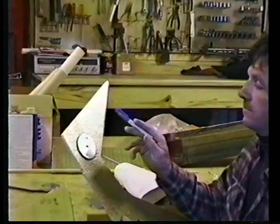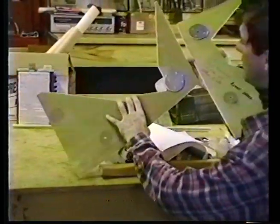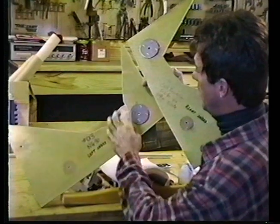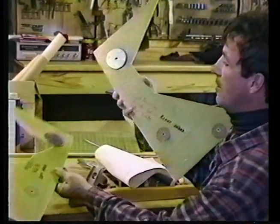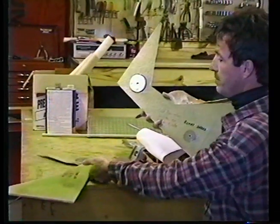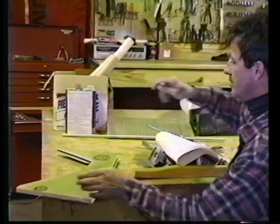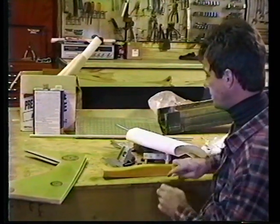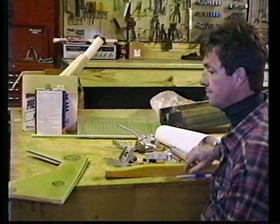But again, sand the phenolic face on the inboard surface. This is the right side, no cutout here. The left has a cutout to allow for the placement of the hydraulic cylinder in this area. After you've trimmed the NG30 bulkheads and installed the NG8 load distribution washers, we'll familiarize you with other elements.